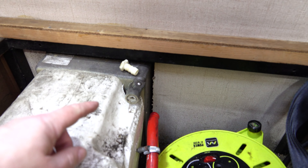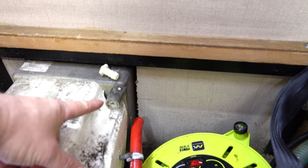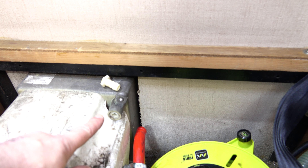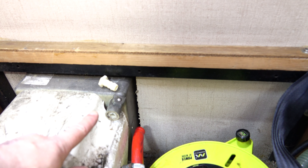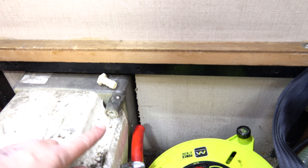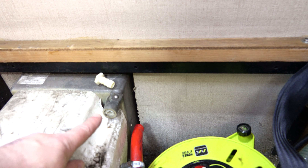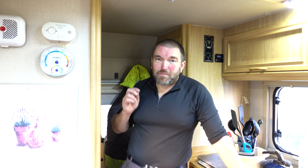So here you can see the problem — the water mist was coming out of this area, and I could see that the hose was moving where it connects onto the barb in a way that it probably shouldn't. So I suspected this and separated the hose from the barb, but as soon as I put a spanner on the barb it just sheared clean off. I imagine it's just got brittle over the years — it's on the hot discharge side from the heater so it probably gets hot then cold repeatedly, and it's probably original so it's 32 years old. It's just finally given up, but it does leave me with a bit of a problem because I've got that threaded section stuck in there.